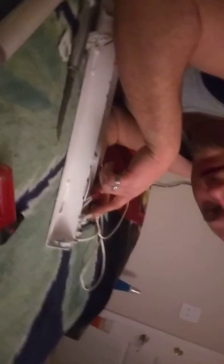Alright, now if you look at this, you gotta really get in close to it if you want to see that detail. Notice how the wire itself, this side, has little lines on it? And then the other side is just flat. You can even feel it too. They're like cut into the plastic. Yeah, I can see the ridges. Right. If you trace that back to the end of the plug-in, you'll notice that right here as it enters the plug, on the left side is the wire with the line, so that'd be that one. And then the flat, smooth one is this terminal.